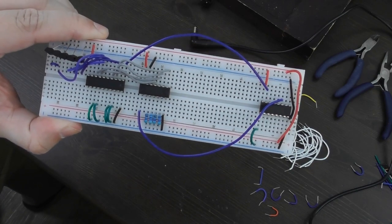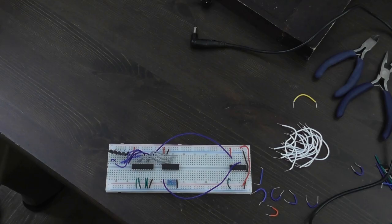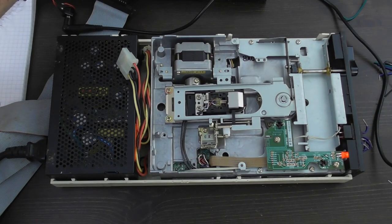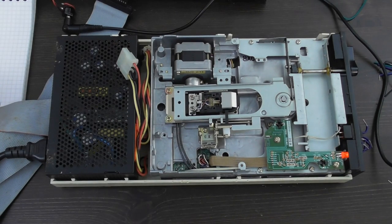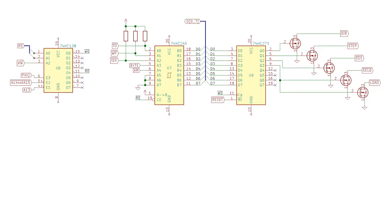Last week I made this CPU interface for my floppy disk controller and connected it up to the floppy disk drive, with the 6502 moving the drive heads around. It's a very simple interface consisting of a decoder, one read register, and one write register connected straight through to some of the control lines on the floppy disk drive. This allowed the 6502 to control the position of the head and tell when it's on track zero.